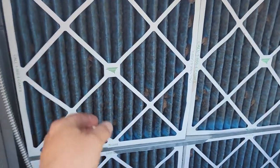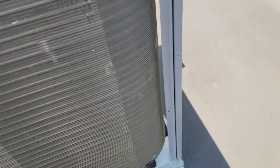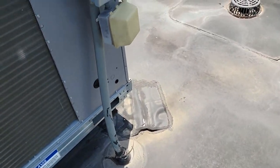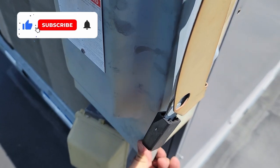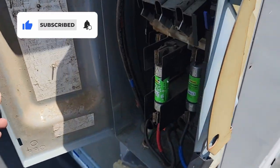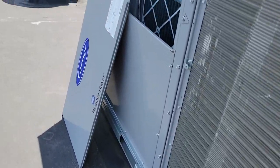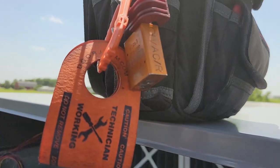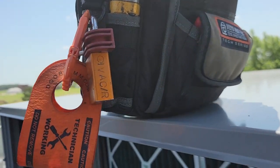Filters still look bad because I'm waiting to get some of the other parts, but that ain't the problem I don't believe. It appears we don't have power. See if we got any friends in here. See if we got power at the disconnect — nothing's running, fan's not running, nothing. Stats dead. So it's pretty obvious that the power's dead, that's why I went ahead and killed it.